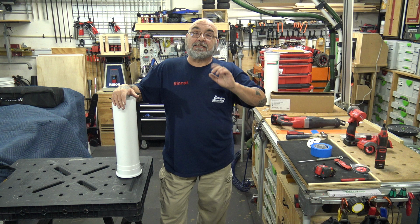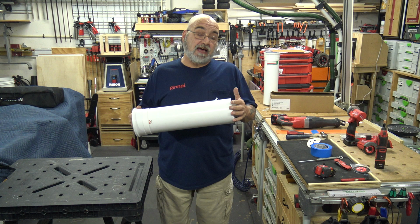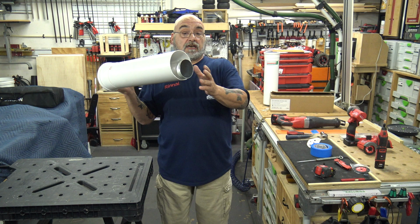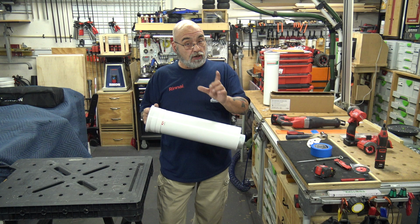All right, today's video is going to be on how to cut Ubbink vent piping. The concentric piping, which I go over quite often, is the type of piping you'll use if you want to use the single pipe on a Rinnai unit, so on a V or an RL series. You'll be using this pipe only, the concentric piping, pipe within a pipe. And on the Sensei series, the RU, the RUR series, the condensing boiler series, you could use either this pipe or others like it, smaller, or the 2-inch PVC.